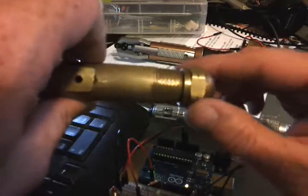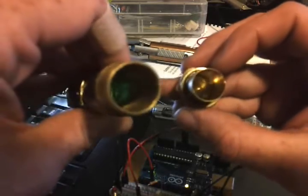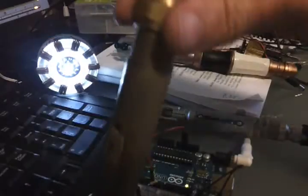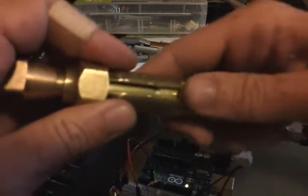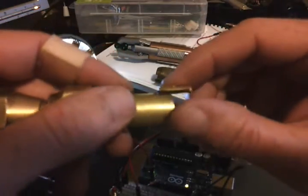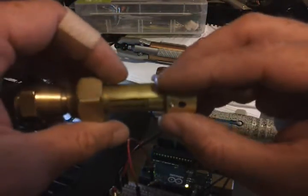Everything is just pressure fit together. This nut here just has a brass sleeve that I glued — you can kind of see the rough epoxy job on the inside. It's the perfect size so that it just kind of slides and then pushes in. Give it a little twist and it locks right there. The top is the same exact thing. It's just got a groove cut into it so that the slide will pass through. Here at the top I tried putting a small screw from the inside out just to hold it a little better, because me being rough with it, I would pop the glue and send the button flying and have to pick it off the floor and glue it back on.